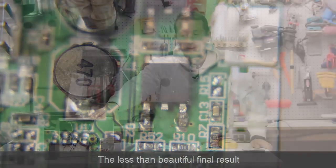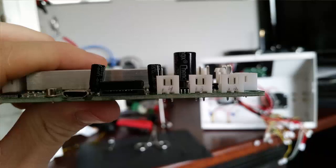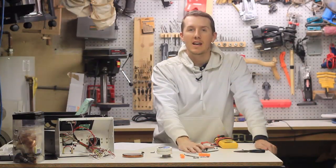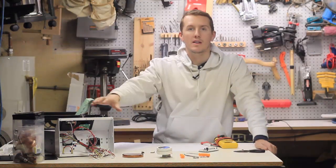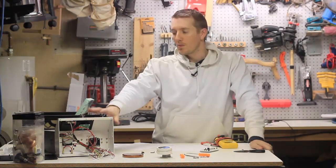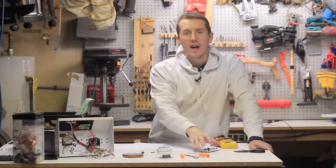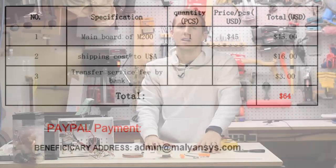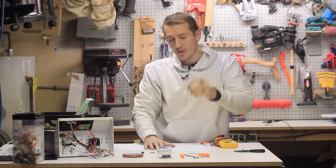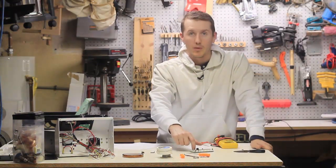This is plan A. I'm about to put it all back together - I also labeled all the plugs on the board and on the case, one to one, two to two, everything up to 14 plugs. Plan B is I contacted the company, Malian, who made the original version of this. I asked if they had a circuit board for the Malian M200, and they confirmed yes, they have this exact circuit board. It's $45 plus $15 shipping plus another dollar for whatever, so it was going to be about $65 to replace it. If putting this new MOSFET on here doesn't work, I can always buy a new circuit board. I'm hoping this little $5 fix of replacing that one bad part will work.